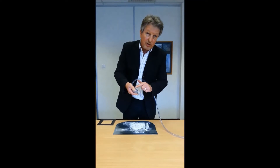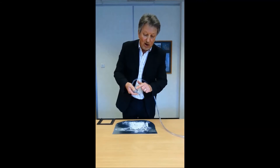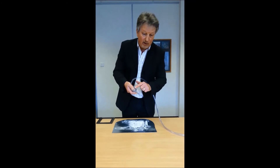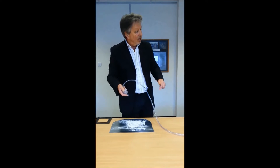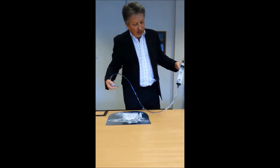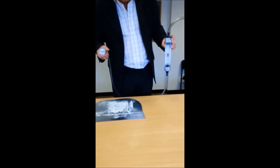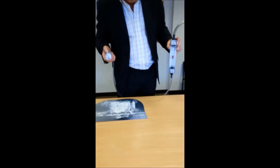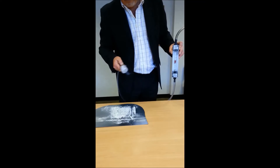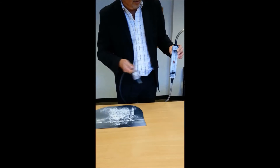It is possible to stall the air flow, but it's very difficult. I want to show you how to use this properly and how to avoid stalling the air flow. Okay, so we'll start up the pump and you'll see that we have 15 litres a minute of air coming through this system. Normally you would take this out after calibration, but I want to show you the flow rate being maintained during the sampling.